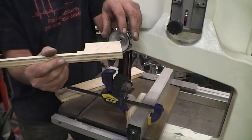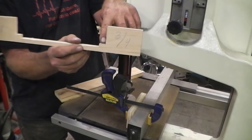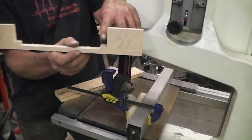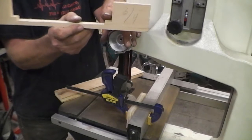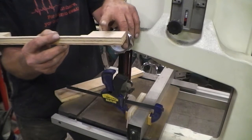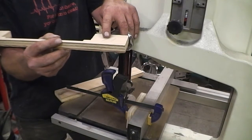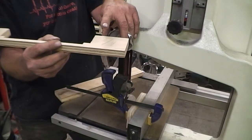Some people say you can do the same thing by using a three-quarter-inch block on all four corners. But if you shove a piece in that's seven-eighths, it's still going to lift up the head. If you're using blocks and a seven-eighth piece lifts the head, those blocks are going to bobble around. I've already had a set of blocks get caught and come flying back out at me in little pieces — it messed up my blades and my planer.